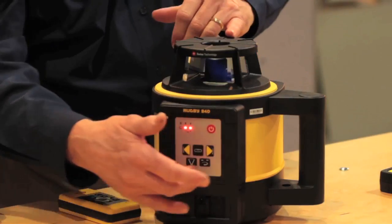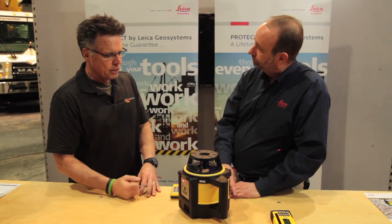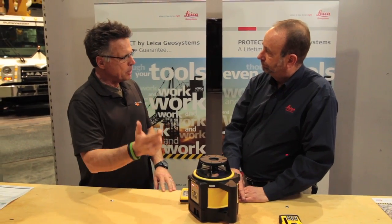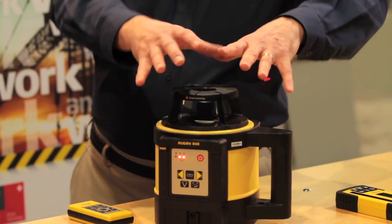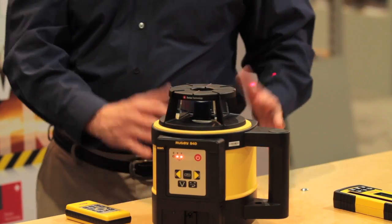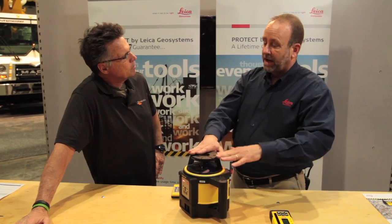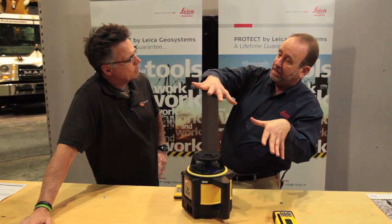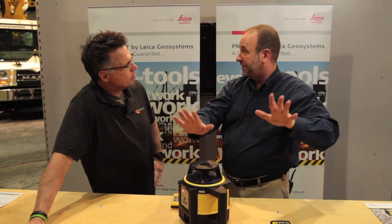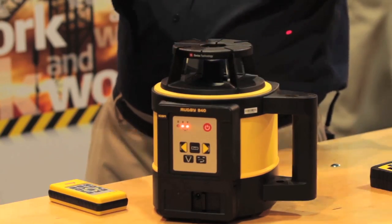You've got a simple keypad here and your full function remote. A lot of rotating lasers will set off an alarm and you have to go back and reset it — this one just automatically does it for itself. The self-leveling feature gives you a full 10 degrees of range to level. Then it sits there and waits for 30 seconds and says, nobody's bothered me, so now I've gone into what's called an elevation alert mode. That elevation alert allows you to still have self-leveling, but if somebody comes by and kicks the tripod a little bit and it was to sink and totally re-level, you may be at a different elevation — you don't want that. So it'll shut itself off and start beeping at you, telling you to come back, set it back up, and make sure your benchmark is correct.